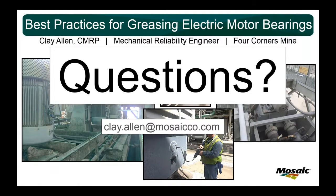But what happens is when I go to re-grease, I end up using like 40 shots to clear out that old thickener and get new grease with oil in the thickener down to that bearing. So what I'm considering is doing a type of purge, maybe a relief fitting at the bottom there, or just taking it off and leaving it open, or running it down to an accessible point where we can take the purge off and then add that fresh grease, instead of having to do 40, 45 shots on that bearing each time.